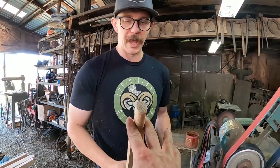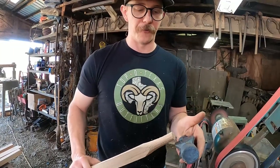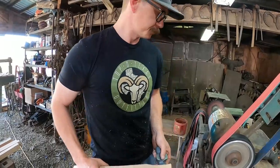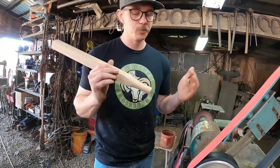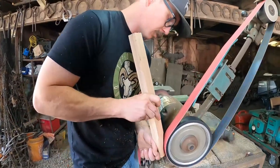Oh yeah, right in here. So that means I'll have to force that big part through the hourglass, but once it goes through, you'll feel it's like rough, rough, rough. You feel like you're gonna break the handle, and then it goes. And how Andy does it, Andy won't wedge them. He'll just stick them in a bucket of water after that and let it swell up. And I have a couple of his hammers that have no wedges in them. Wow.